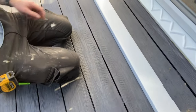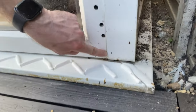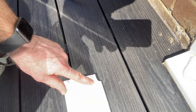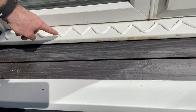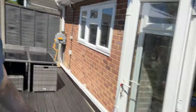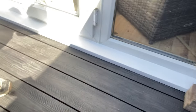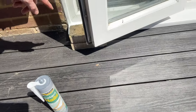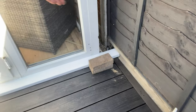It's now officially trimmed — all the way through, very nice. I've done a little notch out using the jigsaw to go around the recess there, and the same over this side for those jutty-out bits. Now you can see my adhesive is all on, evenly spaced. All that's left to do is take that, splodge it on. How much better does that look? I've sealed it in place — glued and siliconed. I've got a couple of bricks just to stop it trying to protrude forward at both ends. The silicone will go off fast because of the temperature — it's quite warm out here. That is essentially done.